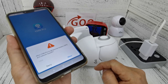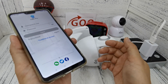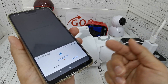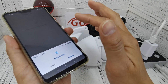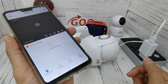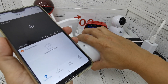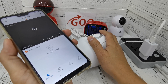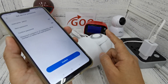Whatever permissions the V380 Pro app prompts when you first use it, just allow them. Enter the app — you can register an account later; for now we try without an account. When you enter the page it will detect the CCTV. Click the connect button. If you do not see any prompt, just refresh and it will appear, because your phone is already connected to the MV hotspot. Note: this is a direct phone-to-CCTV connection only — not through the internet yet; your CCTV is not online yet. For first-time viewing, you need to set a password. The original password is empty, so you set your own.